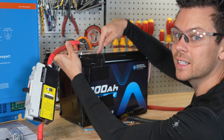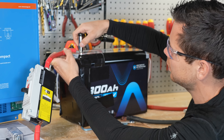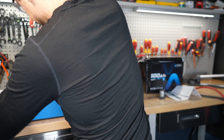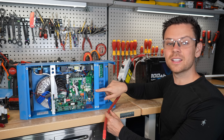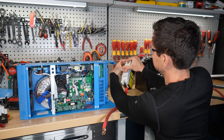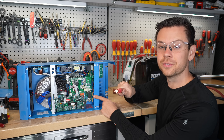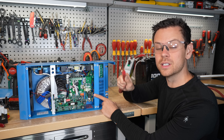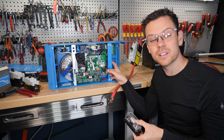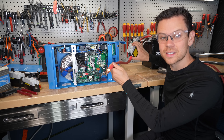The lug needs to directly connect to the battery terminal — do not use any washers in between. Then tighten the terminal to the proper torque spec in the battery manual. Now connect the inverter, but ensure the breaker is in the off position first. You can safely connect the cable, but ensure that the lug also fits the inverter — read the manual and see what they recommend. If you're using a fuse, connect the cables to the inverter first and then the battery second.